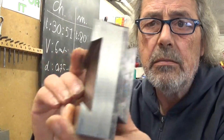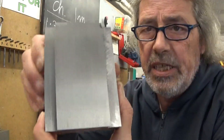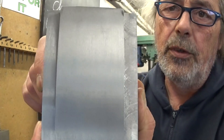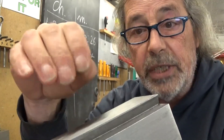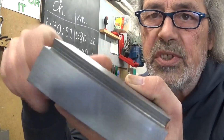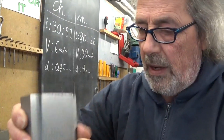A make-something testing video is not complete without showing the test piece itself. So here it is. As you can see, I managed to cut to the outlines, no problem. When we look at the finish, you can clearly see which side is done on the shaper and which one is done on the milling machine. There's a little bit of a rim left — I didn't take the time to cut it completely on that side because I was tired of it. For me, it was clear that the shaper was much faster, and the shaper side is nice and sharp with a much nicer finish. So next time I have to make a dovetail, I think I know what machine to choose.